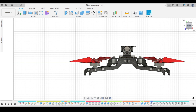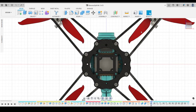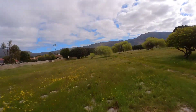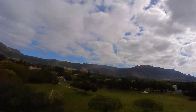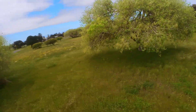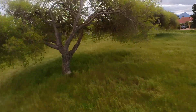I was also able to tilt the motors outwards 10 degrees. This should, in theory, improve stability a bit at the cost of a little bit of thrust, but also it just kind of looks cool and different. I've got to thank Zach Carrizales here — he gave me some frame design knowledge bombs. He's quite an expert. Even though you may not have seen his name around, he's behind many of the really awesome frame designs from Newby Drone. He coined the term 'central dihedral' for these motors tilted outwards, so maybe I'll call it that. Thanks to him.